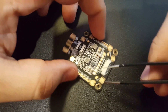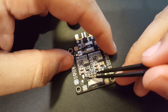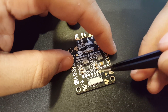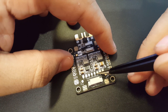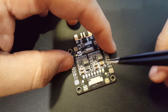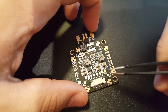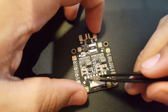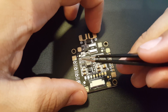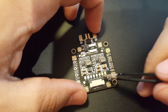If you're not going to use the flight controller that comes with it, you would solder the signal pads here to your own flight controller. You can also take your signal directly to your flight controller — two ways to do it, just comes down to how clean you want it to be. They also give you an additional 5V pad and a 10V pad, so you get two 10V pads and three 5V pads total, which is plenty — I really like this, it looks very promising.